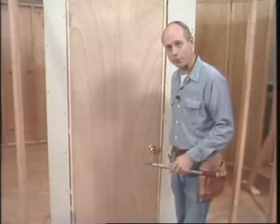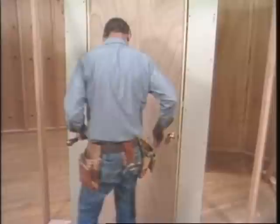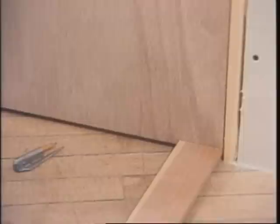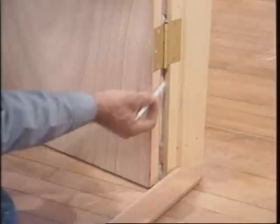Before I leave the door, there are a couple other things I'll show you. Sometimes you have to cut the bottom off. A half inch would be the normal clearance on the bottom of the door, but it really doesn't matter — just so it'll clear any obstructions. There are several ways you can go about it. You could scribe it. Or suppose you had an additional floor thickness — it could be tile, an area rug, or a marble threshold. Just put the material up and then mark it. Suppose the door has been taken down for new carpet and it needs to be cut off. Just take the measurement from here down to the new surface and then measure from the same point on the door. Now I'll show you how to cut the bottom of the door off.